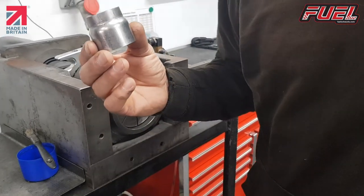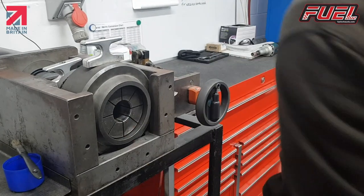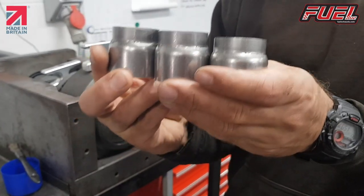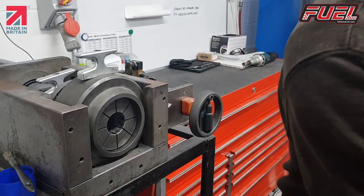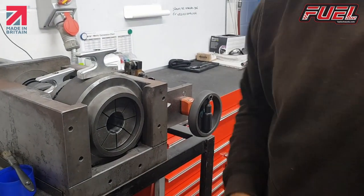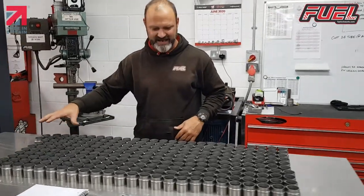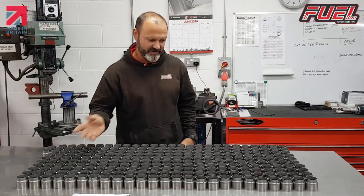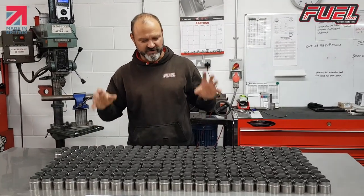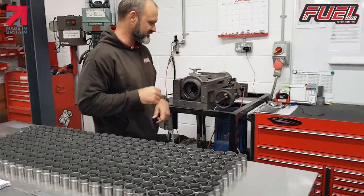So that will size that exactly the same every time, so we get a uniform size all the way through our parts. Okay, we've done the first stage. These are all ready now for the next stage, taking them down 5 millimeters. Going to swap the tooling now to go down to the next stage. If you want to follow me, I'll do a tooling change and show you what's involved.